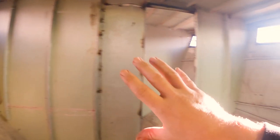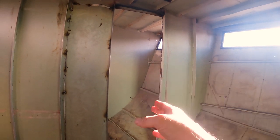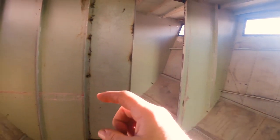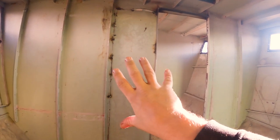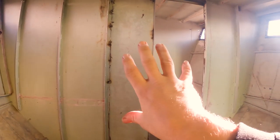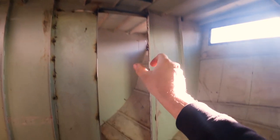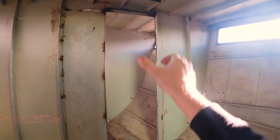that we want to go this way, and I may not be able to put that piece back in there because it's been cut on a taper. If I put it back over there, we're not going to have a very square doorway. So I might, yes, take that panel out and then straighten it up, put that back, but in the correct length, and then I'll just buy a 100mm plate and weld that 100mm bar in. Because that's going to give us a perfectly straight line.